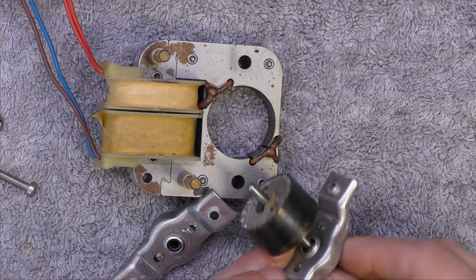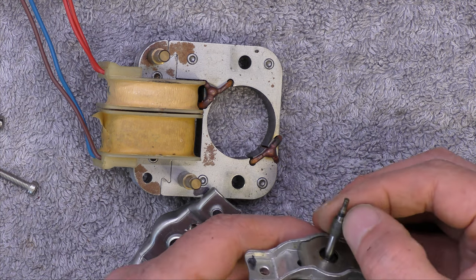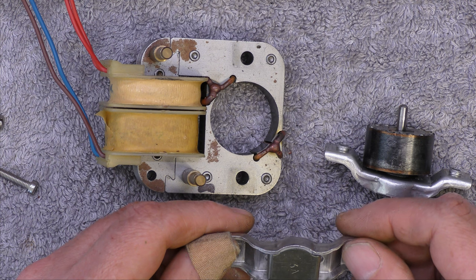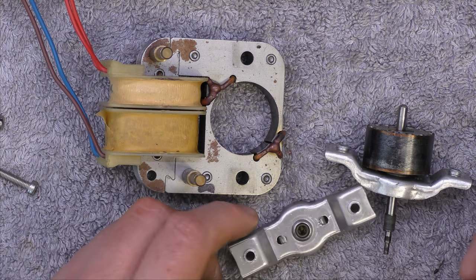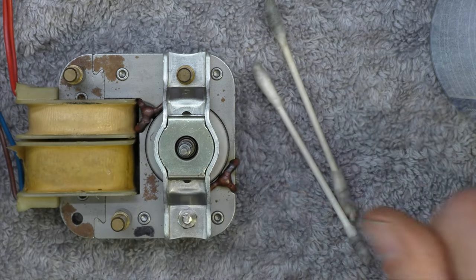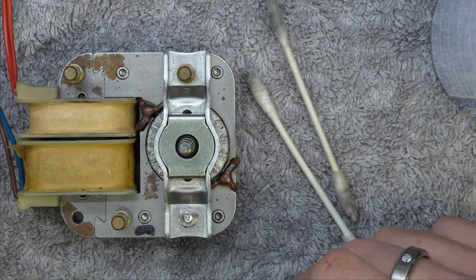Here's the rotor, and you can see it's got some bits drilled out of it, no doubt for balancing. I'm just going to clean up the shaft - this top bit looks quite worn, it's got rubber on it. Sometimes these have a little bit of felt in that wicks up the lubricant, sometimes they don't. I put a little bit of lubricant in and it hasn't poured out the bottom. The reason I mark it is because if you assemble it the wrong way round you end up with the motor going backwards, which is not very funny. A little bit of IPA to clean it up and a bit of sewing machine oil, and now it's back together. I managed to rub the mark off but I knew which way it went anyway.